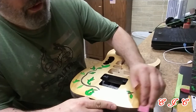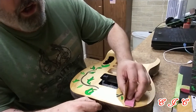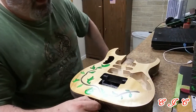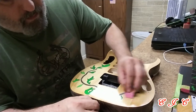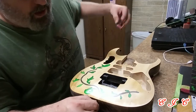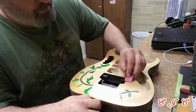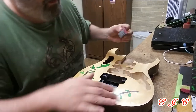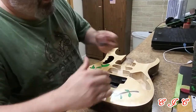Now you want to overlap the edges, but not go on an angle. If the surface is flat and there's no angle on the edge, don't make one. You can see this clogs up pretty fast on the paper, so we're going to end up switching to a clean spot. You can hear it cut pretty good, but it clogs up real fast. Nice and smooth — no bumps, no high spots, no waviness, no nothing. Feels really, really nice.